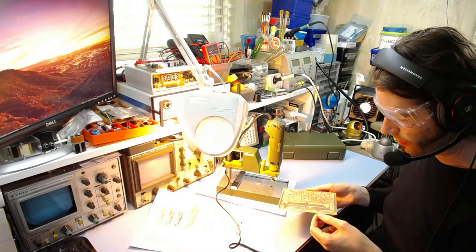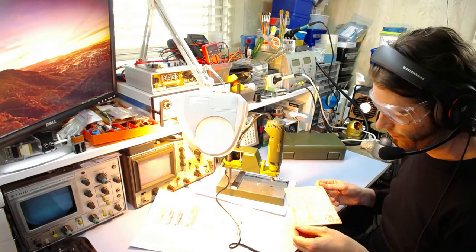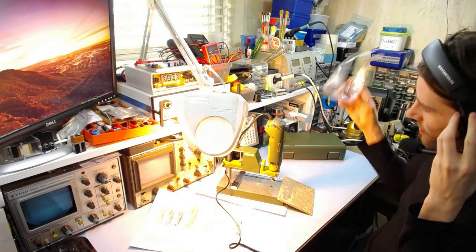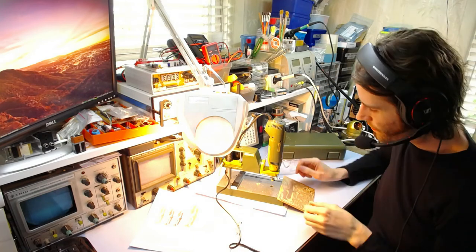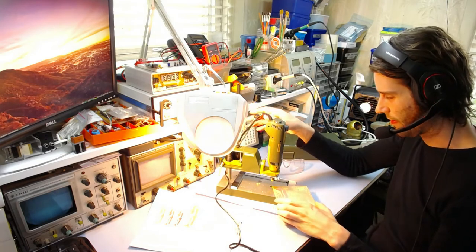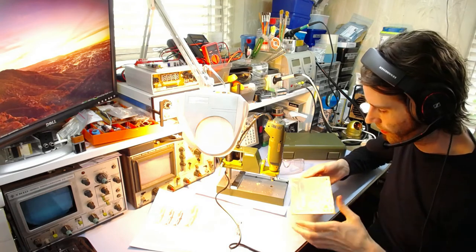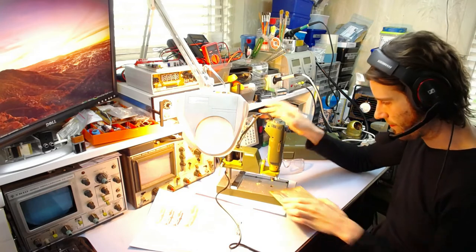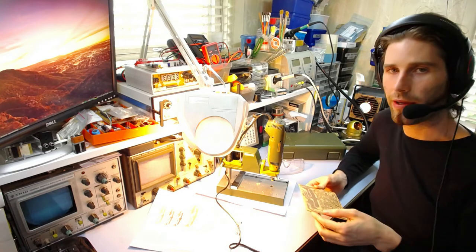It's a bit strange to start off with when you first do this, to get an idea of where the drill is going to come down to actually do the hole. You get really used to it quite quickly. You can see where the tip of the drill is going. And like I said, if you've already etched the holes out on the pads, it's really easy. You can just line that up by eye, and as it comes down, you can pretty much tell. After you do a few boards or a few holes, you get quite used to it.